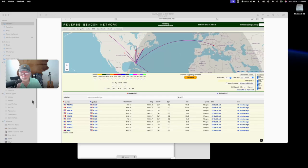Well, how did my beach inverted V work? Receive signals were blasting in — F8DGY in France was 599 plus. As for me, I wasn't exactly bending anyone's S meter, but I'll share with you a screenshot from the Reverse Beacon Network. My farthest contact was S54L in Slovenia with a signal-to-noise ratio of 12 dB. Not too bad.